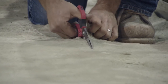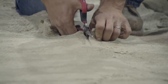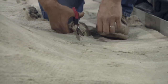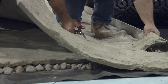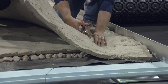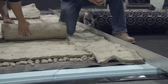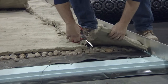It's really important that when the mineral wool is finished, just like in a growing medium type system, it needs to be fully saturated. Once the plants are installed on top, they need that moist area so their roots can grow into it. This layer holds 25 litres per square metre, so getting water on it immediately is really important — one section should be fully watered so plants can be installed on that section as the rest is being laid out. Watering is definitely critical on a roof.